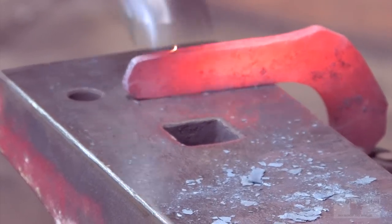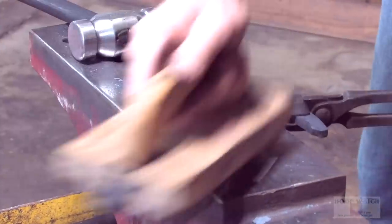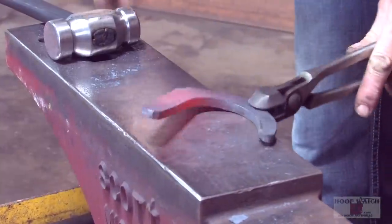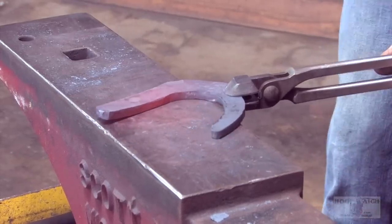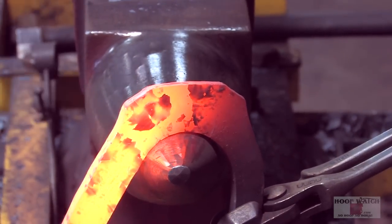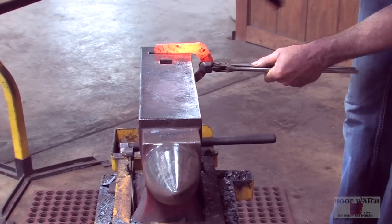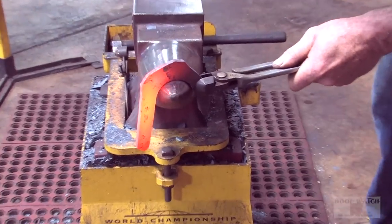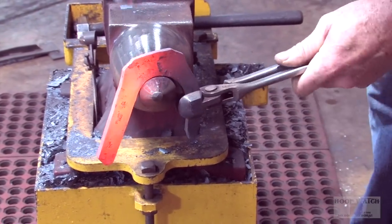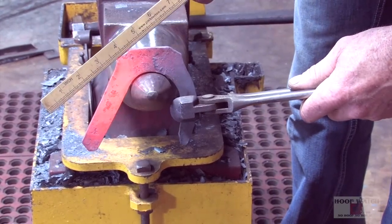Then you come here and I keep it off the horn. And then flatten her up really good. I have a ton of material on this inside edge. You can see how I picked that up. Constantly just, I'm way out on the tip here. And you can see now, I've got my toe, and then I've got the angle that comes off the toe.